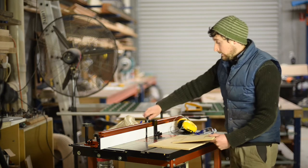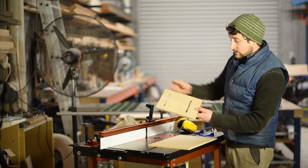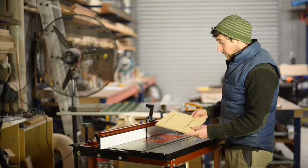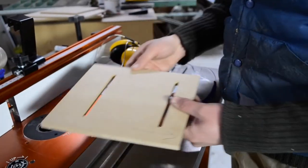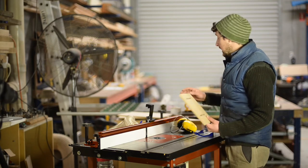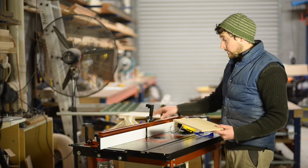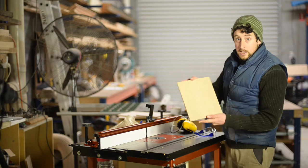Now the way we do this is we just get the stop out of the way. We've got our 30mm lines on each side — this is one I did earlier but I will go through the cutting process. We want to be holding our plate so that the short edge is along the fence. We're going to plunge that down with the router going until it comes through, then slide it all the way over to one of our lines, all the way back to our other line. We're going to do that on both edges and those will give us our two slots, and we know our slots will line up exactly with our holes — which is the reason I'm doing it all on the router table. So this is all set up, the fence is in the right place, and I can do those cuts now on my uncut piece.